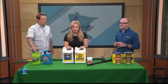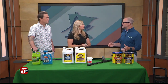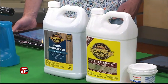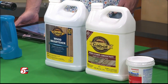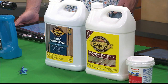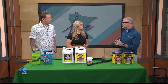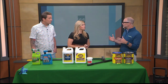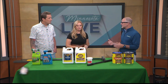Next level is if you have a wood deck — let's say you have a cedar deck. At one point in time, you put it on your cedar deck and it looked like cedar, it was really quite pretty, and it was very protected. Well, a couple years in, it turns that deep gray. So what you want to do is come back with Cabot products like this and work this in with a deep brush. It's concentrated. Work it in. Your deck will look different overnight. It's a ton of work, but it will restore your deck to that cedar look, and then you can protect it after that.